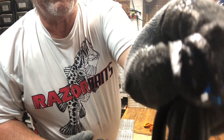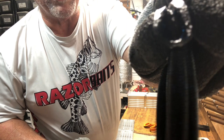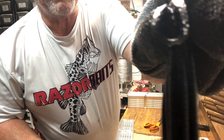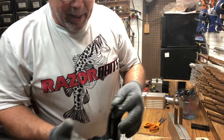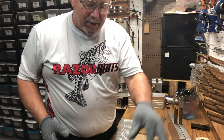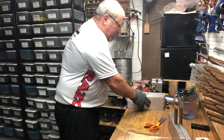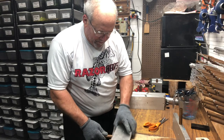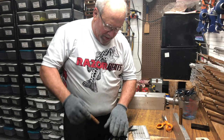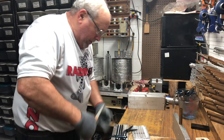And I guess when you're shooting 10 cavities and you're shooting for fun, it really doesn't matter. But when I'm trying to produce 400 bags of 10 count, 4,000 baits, I've got to make sure I don't have air in them, and I can't sit there and keep going back and top it off. That's why I made the sprue extenders. And it's pretty consistent with the sprue extenders as far as the amount of air that is left in them after you shoot them.